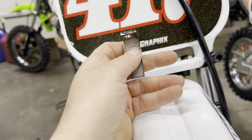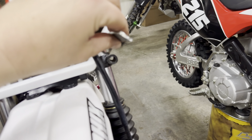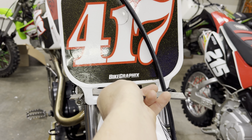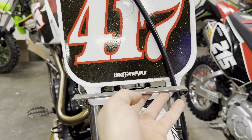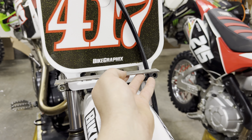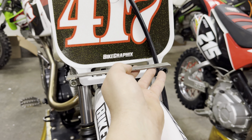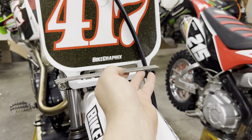It's not gonna be the prettiest. I went a little crazy on the grind so I gotta take a little more out, but the idea is these brackets go flat like this, and then we have this piece of metal that we're gonna weld in connecting the two. Once it's tacked we'll pull it off, fully weld it, take the grinder to it to smooth it out, throw some paint on it, and then we'll be able to mount the light. Simple design — shouldn't look horrible on the bike and it'll be super sturdy.